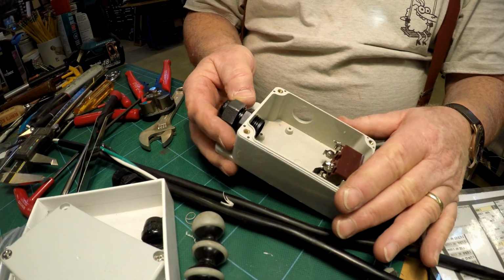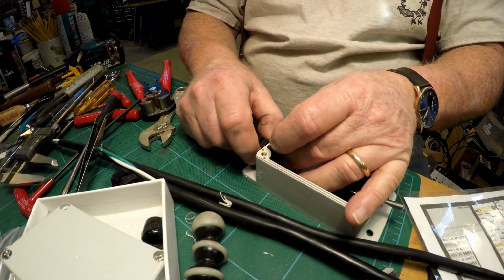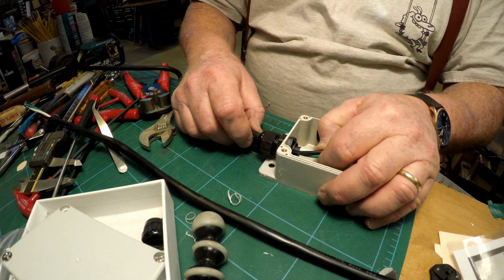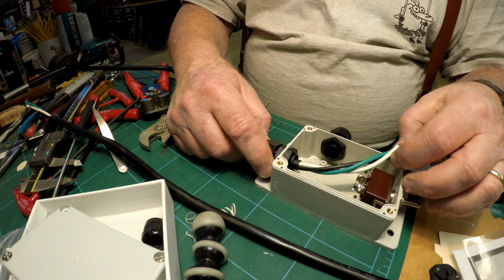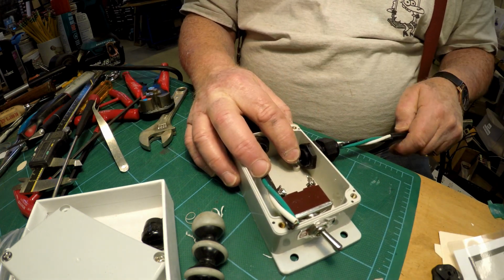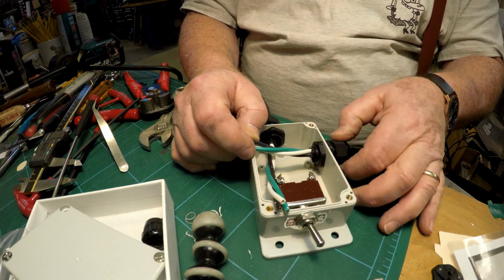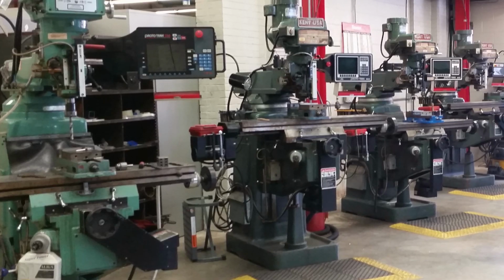The other significant advantage of a VFD is that the actual motor that turns the spindle is a three-phase motor. And three-phase motors are much more powerful, more efficient, and far happier than single-phase motors. They start faster and stronger, they run cooler and smoother than single-phase motors. Most all industrial machines run on three-phase power, so the electric company supplies it to factories and big machine shops.